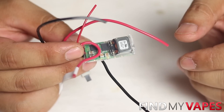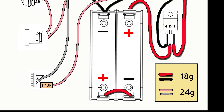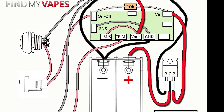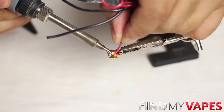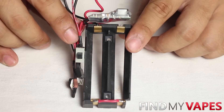Let's take a break from the OKL chip and move on to the battery sled. Looking at the wiring diagram, the battery sled is wired in series, so we need to bridge the bottom contacts with 18 gauge wire. On the top negative contact, two wires connect: the ground from the OKL chip and a wire connecting to the ground of the 510 connector. On the top positive contact, solder the drain wire from the PFET.